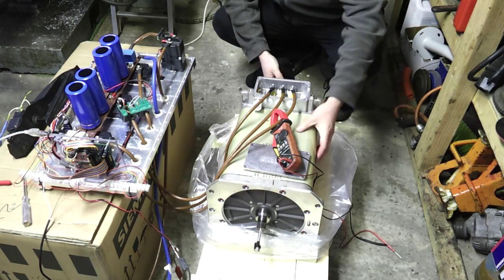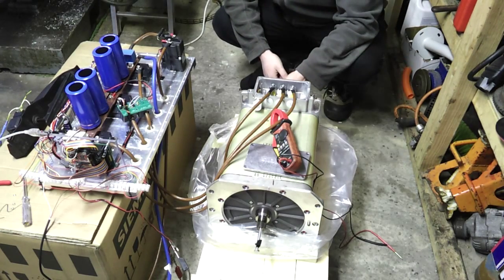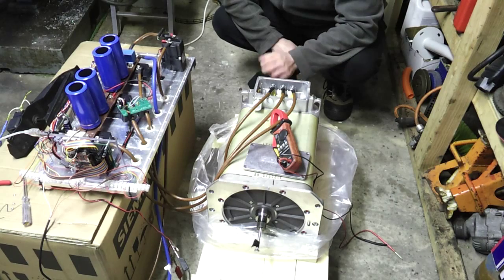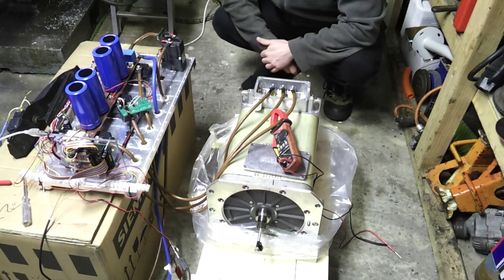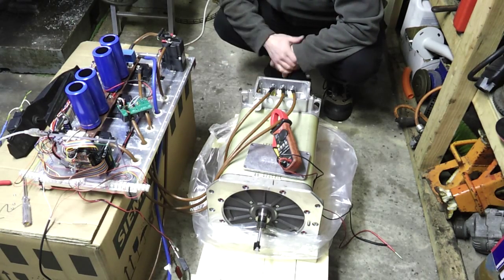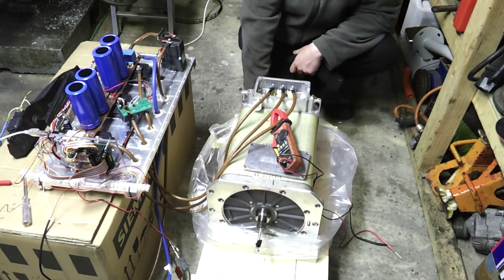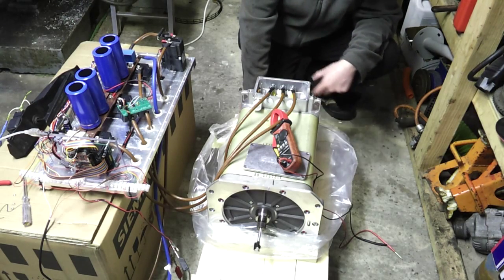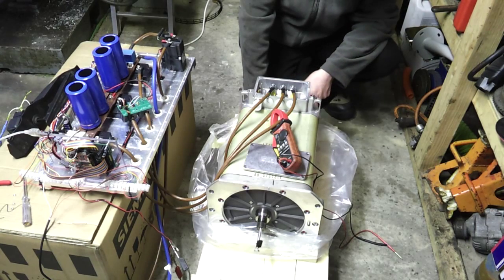Just running at one Hertz there are absolutely no vibrations or anything out of the motor, so we just need to work out the parameters. There's also a temperature sensor in this motor - not sure if it will be compatible with what the software currently uses. I know a KTY83 sensor has been specified for the motor temperature sensing, so we may have to bolt one of those into one of the spare positions on the casing.